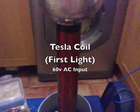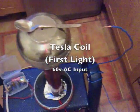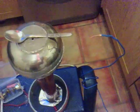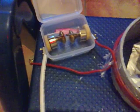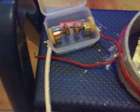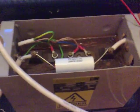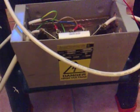I've got my secondary coil here hooked up to a top load with a spoon on it, and there's a ground there. That ground goes straight to ground. I've made a spark gap over here out of two neodymium magnets to help quench the spark and a couple of door knobs. That comes round to the capacitor circuit, which is inside my neon sign transformer.